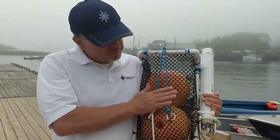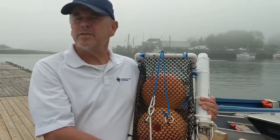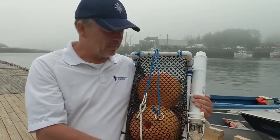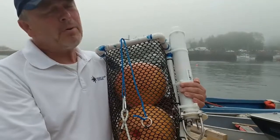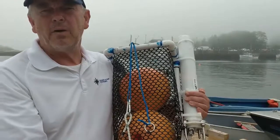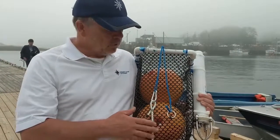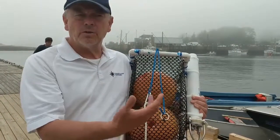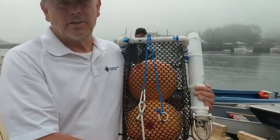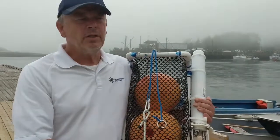First thing, be sure to really inspect your bag to see if there's any snag potential, maybe snags that haven't been identified in this video yet. Second thing, be prepared that a snag may happen, and when it does happen, you should have an alternate way of getting back your traps or trawls, such as grappling. Third, once you recover your snagged gear, have a close look as to what happened. You should, in most cases, be able to identify what caused the snag. Fourth, develop a suitable solution for it and try again.